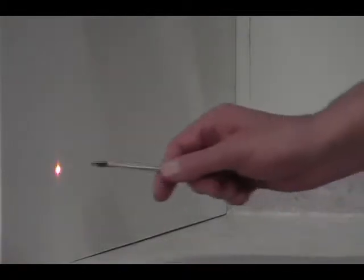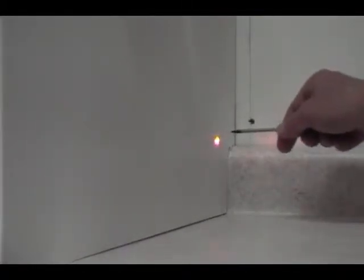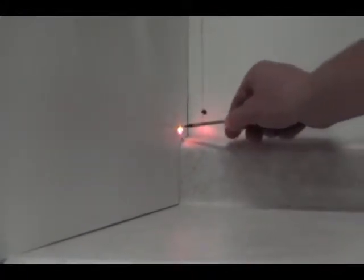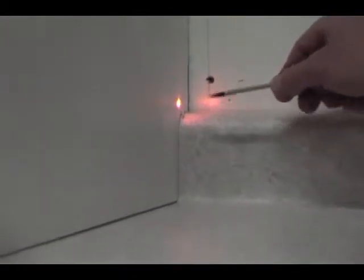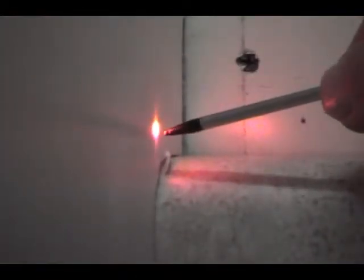Okay, first of all, if I put one point here and my second point was over here, let's say it moved close to the corner. Notice this reflection there. Now if we just leave this there, the angle of the encoder goes here. The laser could possibly pick up a reflection here and come back, which adds to the distance of this measurement, which would effectively move this wall this way and cause your back wall to be a longer dimension.